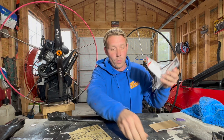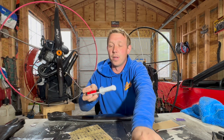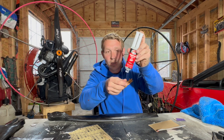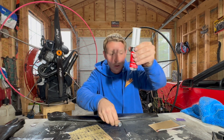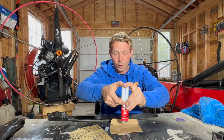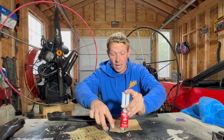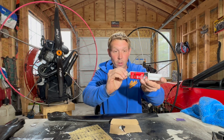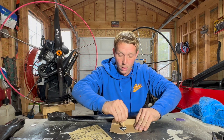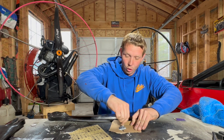This comes with a cool little mixing stick. What's nice about this style of JB Weld — the reason I buy this kind — is that it's super easy to use. When you press it out, it equally comes out of both sides. All you do is untwist the bottom, press out as much as you want onto a little piece of cardboard. We're probably not going to use any more than that — you'd be surprised how little you need. Put the cap right back on, and I get to use that again if we have another mistake down the road. Now all you do is mix this up until it turns into a grayish, darker color.